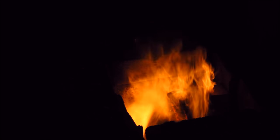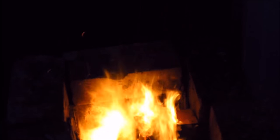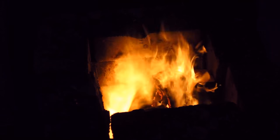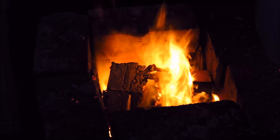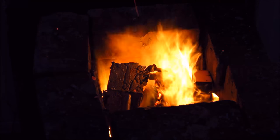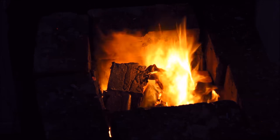As you can see, I've got it stoked well up, but I'm not really sure how efficient it is. I think there's as much burning above it as there is below and to the sides, but maybe it's better than what I thought. I'll chuck in this other piece of leftover aluminium and we'll see if it'll melt back down direct. That's certainly going to be in the flames. I lined the bottom of this with the sand and clay mix, so it should just puddle and hopefully I'll be able to pull it out without too much problem.